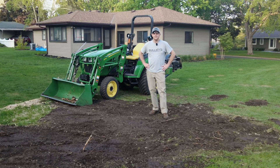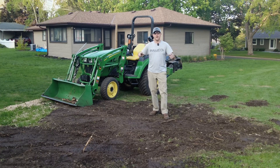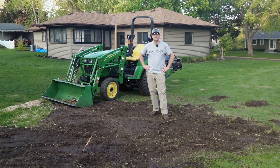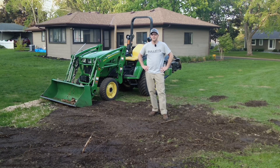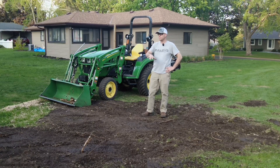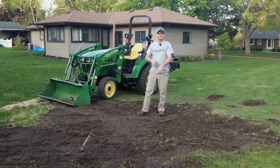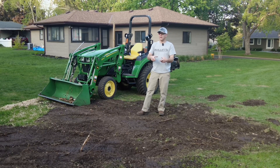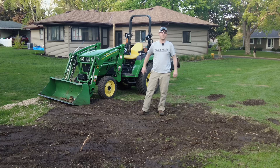We'll do a quick little outro. That was a 27 by 38, kind of an oblong ash tree — medium hard, ash is fairly hard, harder than a pine. And you saw us de-stump a pine too. That's how you can stump remove on a little compact tractor. I have a stump bucket — those are good for five, six inch trees at best. It wouldn't do a hill of beans on a three-foot ash tree. Not going to happen. About an hour of tractor time to take the entire stump out.